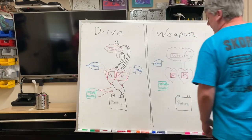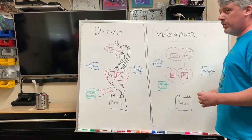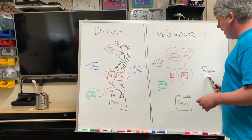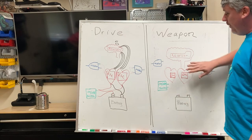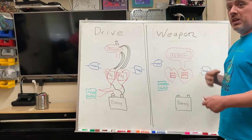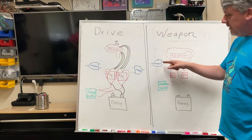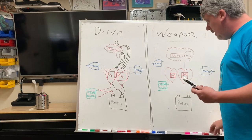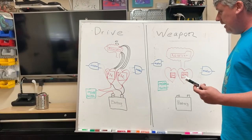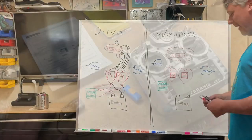Next up is the weapon system. I'm going to recreate what Scorpios does, because Scorpios has a saw motor and an arm motor — so we need two ESCs and two motors. If you didn't have an arm and you were just a spinner like Tombstone or any of the four-wheel verticals, it's just an on-off switch, one ESC, one motor. But I'm going to show you Scorpios's setup — it's actually completely identical to the drive system. Rinse and repeat.